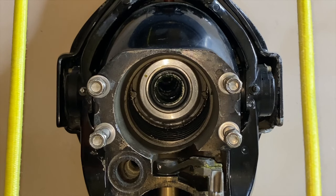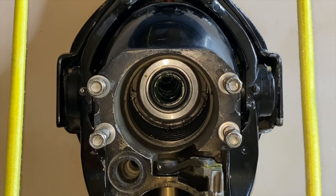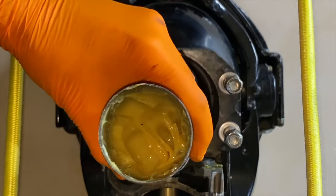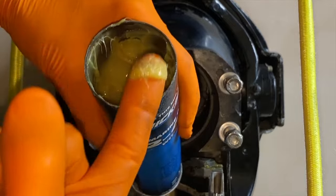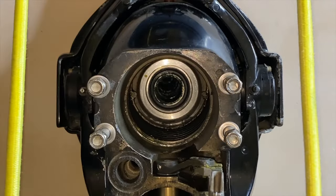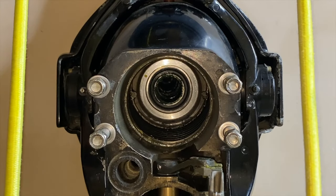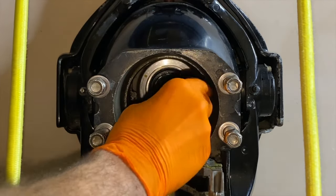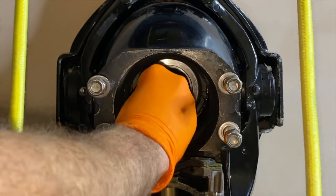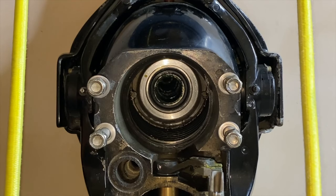Back looking at the bell housing, I'm going to grab my Marine 2-4C with Teflon. With the cap off, it's a tan color — just grab a little bit. I'm going to lubricate the ridge portion around the entire circle that the O-ring is going to secure against. This grease will help keep that O-ring in place as I slide the out drive in. I'm using this specific grease because it's what our exact serial number service manual calls for. Don't overdo it. From here, carefully slide the O-ring into place flush with that back stopping point. This will alleviate water from sneaking past and into the U-joint bellows, shaft, and gimbal bearing — if that happens, plan on premature failure of all those parts.